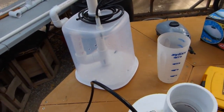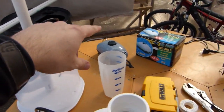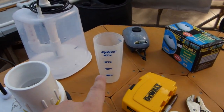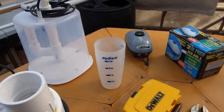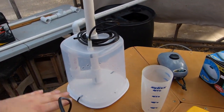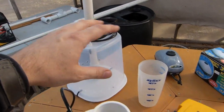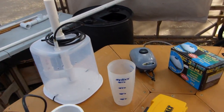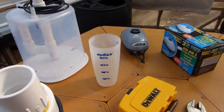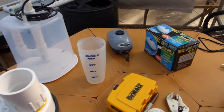If you watched the first two videos, this thing with the three-quarter inch and the two outlets connected into one will pump 12 ounces per surge. What it does is build up air pressure and then release it, creating a vacuum — like a suction up the center pipe — moving one slug of water at a time with air in between. You get a good 12-ounce shot each time, and it takes about 10 seconds using this pump.